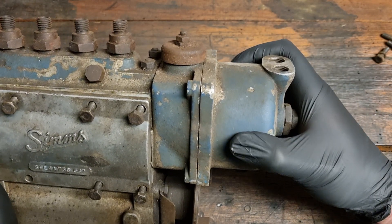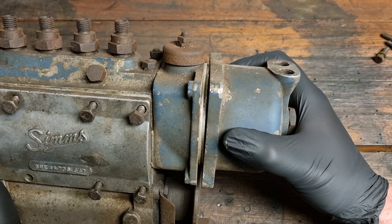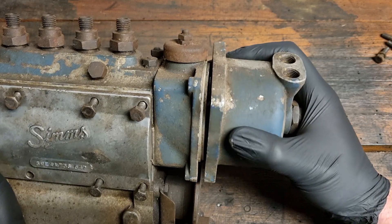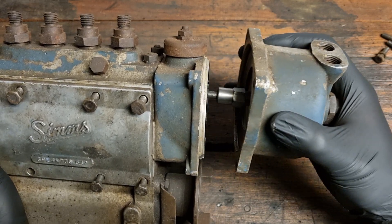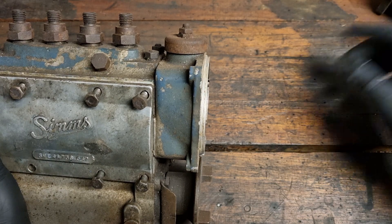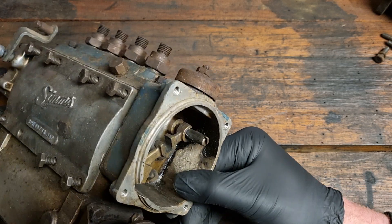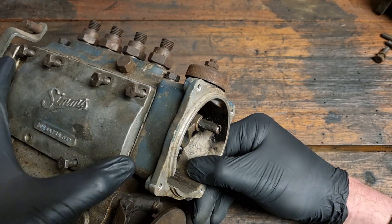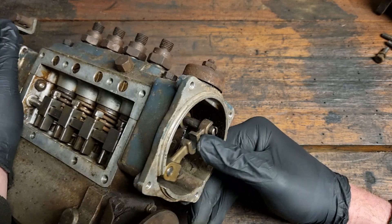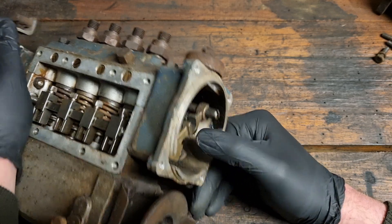Now you've got to loosen it out a little bit. There is a yoke in there that is holding the diaphragm guide, so when you pull out a little bit you have to move it up and out — takes a little bit of practice. So there's the notch in the diaphragm guide that connects into the yoke. You can see the yoke that moves that diaphragm guide. As I push the rail you can see that's moving the yoke — all timed movement that moves the diaphragm in and out.